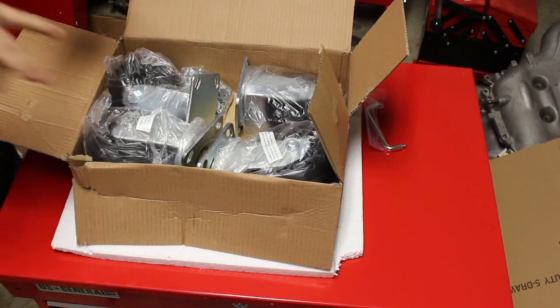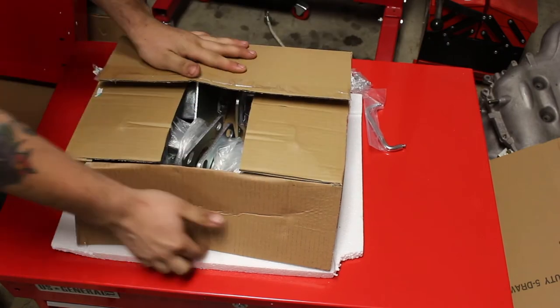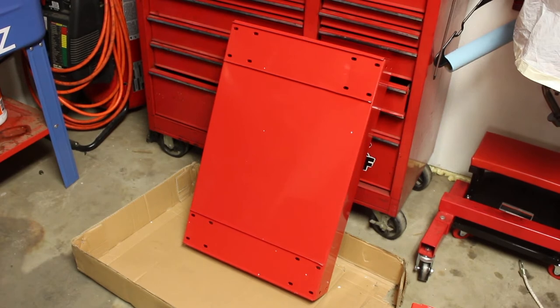Just because I did pick this up from the back, I just want to make sure that the person that returned it didn't return it with anything missing, because that would have kind of sucked. Alright guys, our first step is going to be to install the rolling casters on the bottom of the box. Now, a big note that I've heard from other people as well as from Harbor Freight themselves: only finger tighten these bolts until everything is assembled. Once everything is assembled, then you're going to want to tighten them down. Everything has to fit pretty well, so if you tighten the bottom up and just hope that the top is going to be perfectly aligned, it's not going to happen.